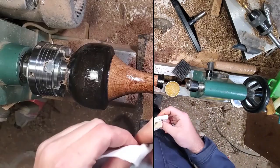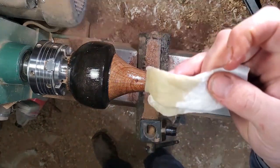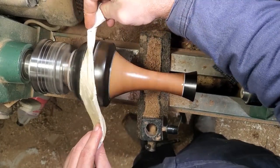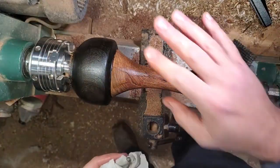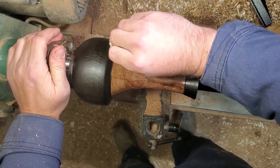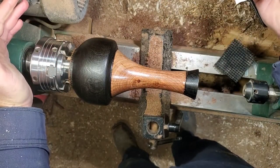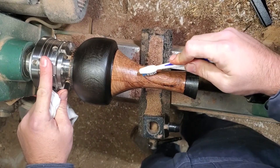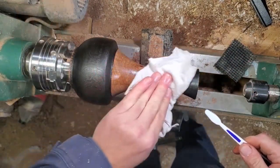Been about 15 minutes, let's spin this up — I'm around a thousand RPM somewhere — and we are going to friction polish this on with the same rag we applied it with. What I like most about this is it gives me a longer-lasting finish than something like shine juice. Anytime I used shine juice it would last two or three weeks, maybe a month, then start to dull. This will look exactly like it does now six months from now — no problem. Use a nice little soft bristle brush to get up in the grooves and cracks — an electric one works well but my batteries are dead, so this will work just as well.